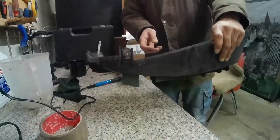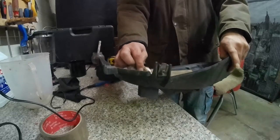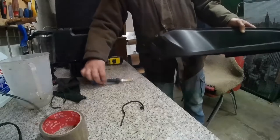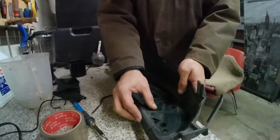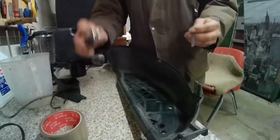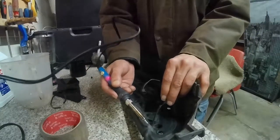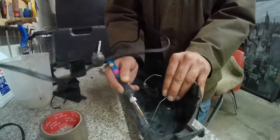When it dries it actually becomes quite hard — you think cable ties are floppy but once melted and set it's solid. Now I'm taking the tape off and it just comes off cleanly. From the top view you can see the cracks but it's not moving — it's secure. Now we're going to do the same thing across the top and fill out the cracks. There's a little section that's actually missing altogether, so I need to find a way to fill that gap.